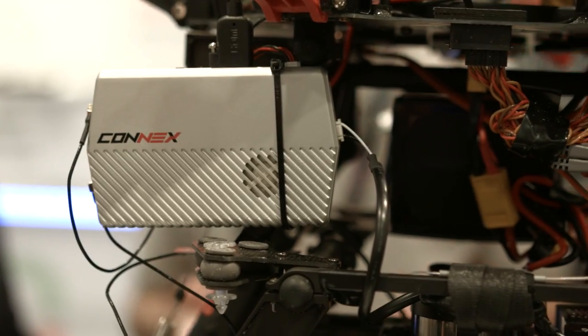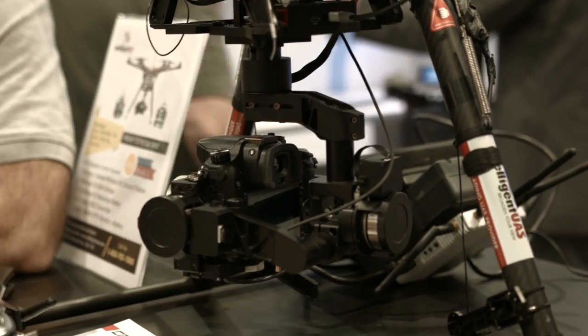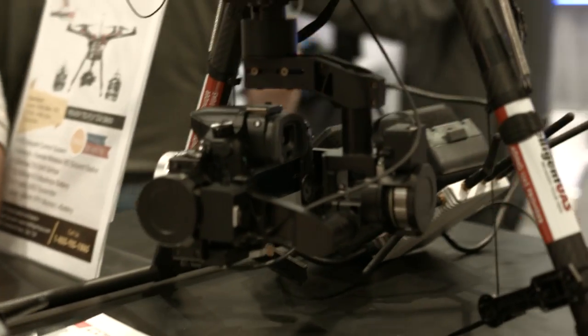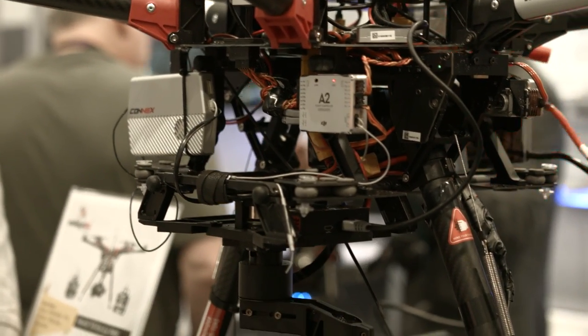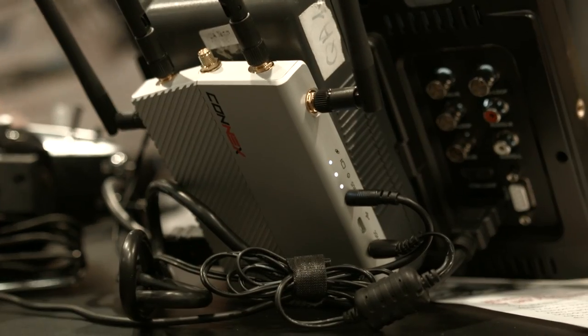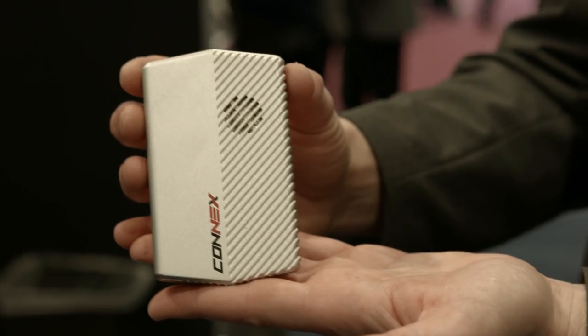The system is hooked up with the antenna and the fixture we're providing for the antenna. You can see this is a portable monitor — this is line of sight. We've designed the system with diversity antennas to increase robustness, so we have a very solid downlink connection. We can pair up to four receivers and multicast — all receivers receive the video simultaneously and are all synchronized. You can hook up any monitor to all four receivers at the same time.